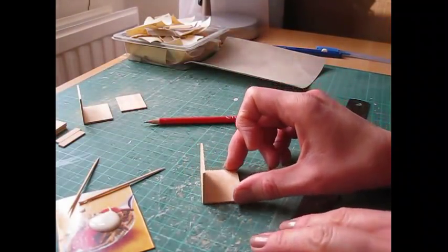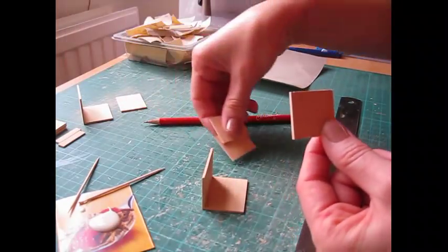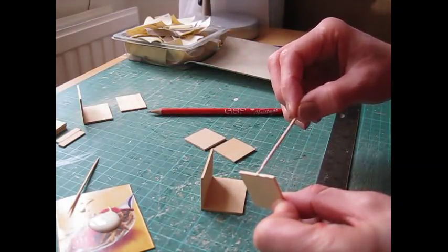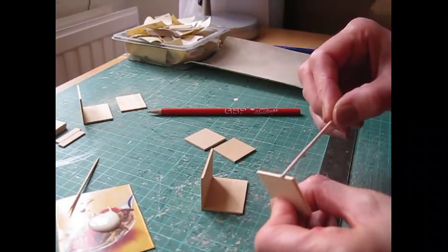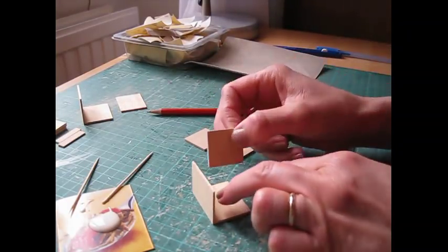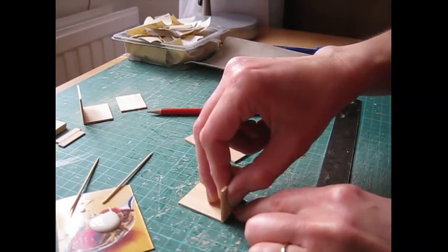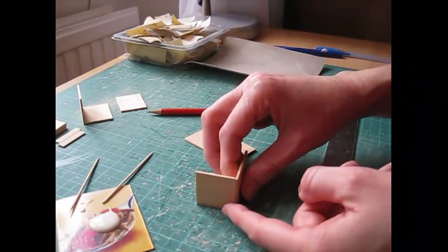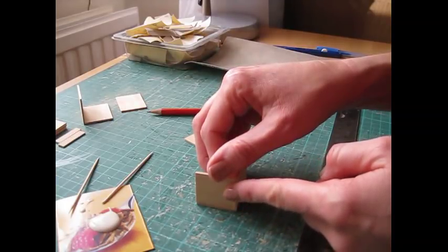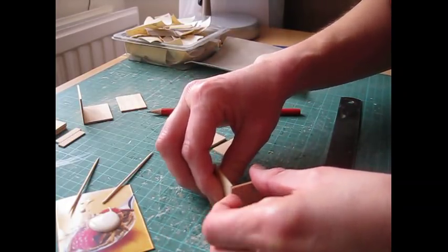I'm making two of these cabinets, so I've made a start on the first one. Take the top piece — you've got three pieces: the top, bottom, and shelf. Apply glue along a short and long edge, always making sure your nicest edge is facing forward. Glue that into place on the inside edge of the joined pieces so it's flush with the top. Pull the side in to meet it if needed to ensure everything is square, and press it all together.